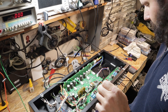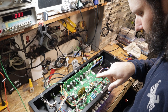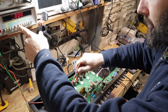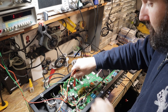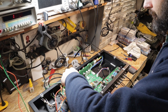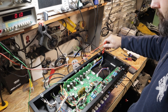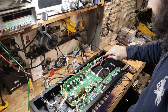The amp has a peculiar setup here for the bias. It appears that in order to cut two tubes out of the equation, what it's doing is disconnecting the cathode to ground on the outer two tubes. I've identified that because it's got some 10 ohm resistors between the cathode and ground here. So if I put my meter here for continuity, I've got like 90 ohms to ground when I should have zero. So if I flip that switch to put it in 50 watt mode, now I've got a completely open circuit. The top terminal has less than one ohm to ground — good. The bottom terminal has like 100 ohms. So I'm getting resistance through this switch.